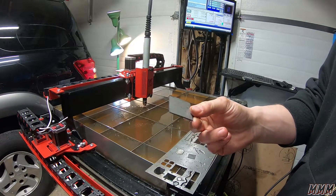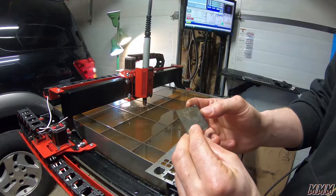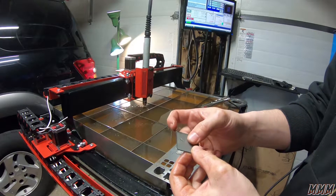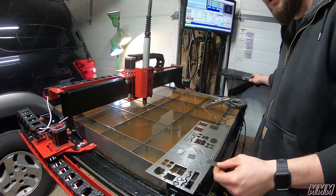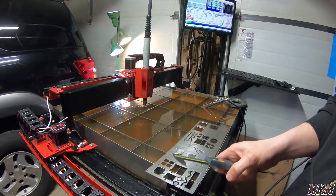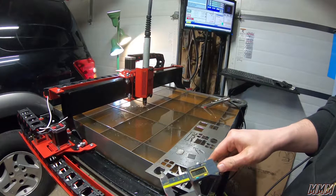Here's how our big square turned out — a little better, but still not acceptable. It's really bad on that corner there. I changed the kerf by seven thousandths to hopefully get this to a perfect one and a half.